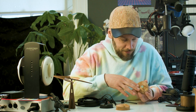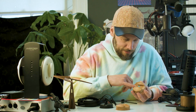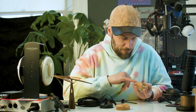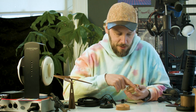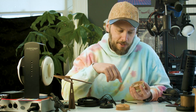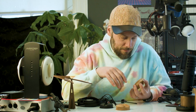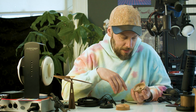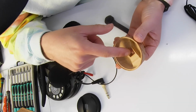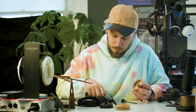Finish on the surface is really nice. Looks like it's been, I don't know, vaguely wet sanded. It doesn't look machined or very finely machined, but it might have been wet sanded just to finish it off. Inside, got a slightly rougher cut on the inside, but there's no need for it to be smooth, so you just do a rough pass with the CNC machine. It saves time, saves money, and won't affect anything really. It just makes it easier to produce. So inside there, all looks good. The difficult part, which will be interesting to see, is getting this hole right, because it's got an ever so slight taper, and that seals against the hole in the center.